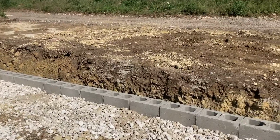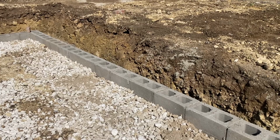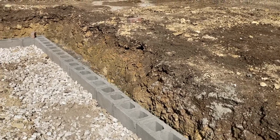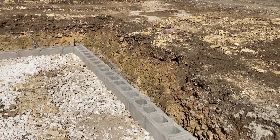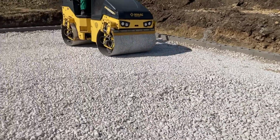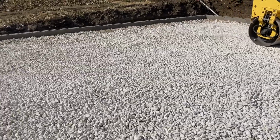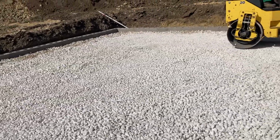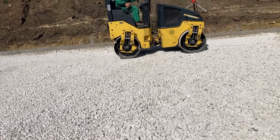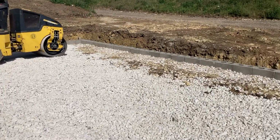The idea is the blocks around the outside form a seal, and the concrete goes up to it, 6 inches up to the top of those blocks, and the blocks are the shuttering. So there'll be no external shuttering, just where we do bits in the middle. I think we're going to do it in 2 strips with a fall slightly to the middle strip, so it'll all run into a sump for pumping out when it fills with some rainwater. That's the theory anyway.